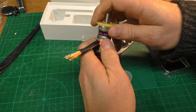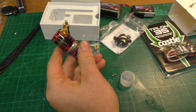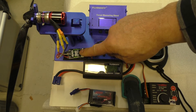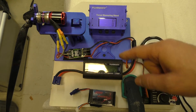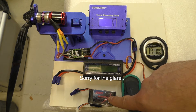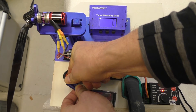So now doing this test: 3.0 volt cut-off voltage, hard delayed brake for the motor. The thrust you'll see in grams, you'll see the power and the current. 450 milliampere hour 3S Magna 70C pack — we'll run this for 30 seconds at full power and see what happens to the battery and other things.